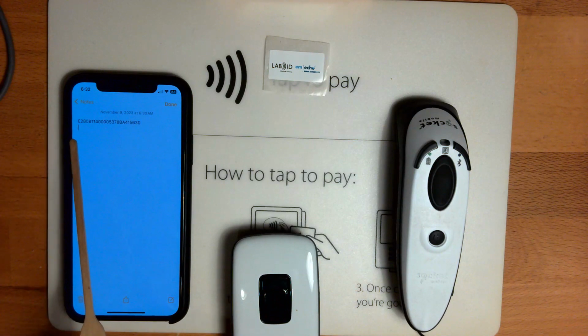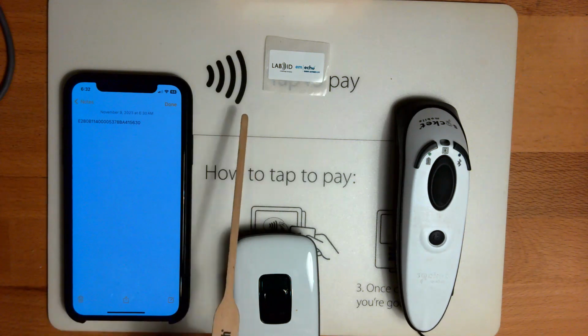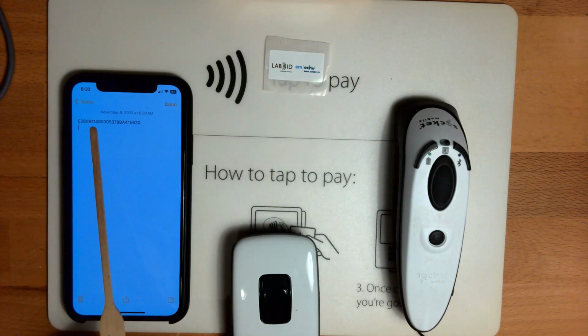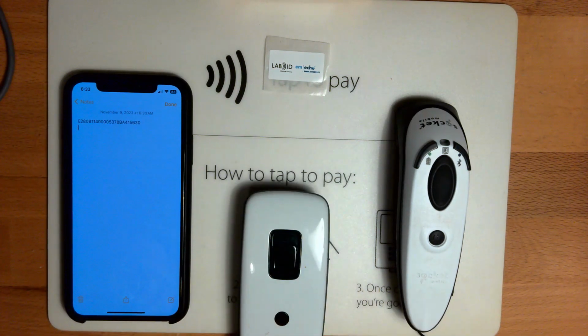So here you can see 96 bits, which is represented as 12 bytes. And in the case of writing in the HF side, at least, it's written into 3 blocks of 4 bytes each. So you can kind of make out that's the first byte, the first block, second block, third block. And that'll become relevant as we dig into the other readers as well.